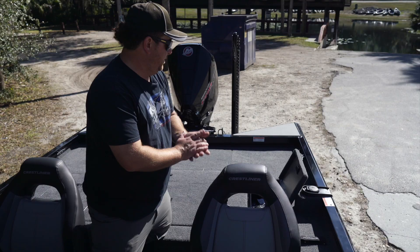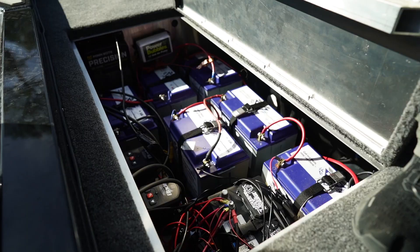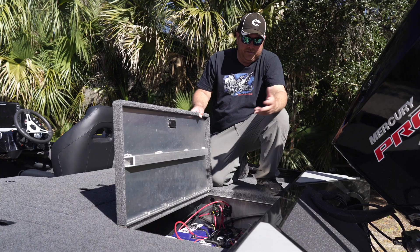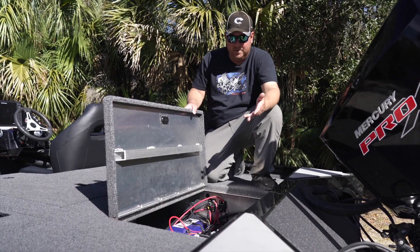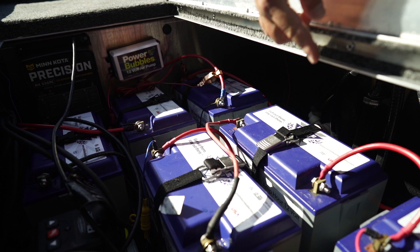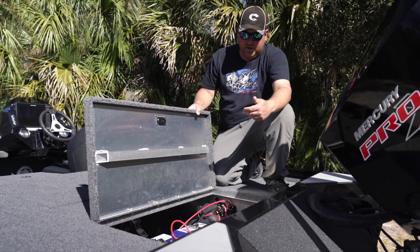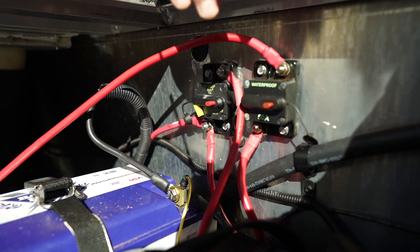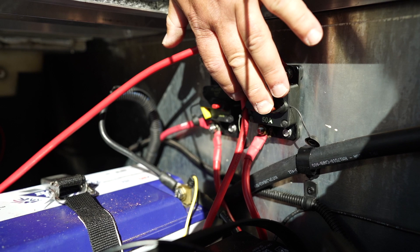This right here is what you won't find in many other boats, especially aluminum boats — this is my battery setup. This is how I keep going in tournaments when a lot of guys' batteries die and they have to come off the water. I've got six 12-volt lithium Battle Born batteries in here, plus a Power-Pole charge unit that charges one set and the starting battery — seven batteries total. Each set is on a 50-amp fuse so I can run one set and switch to the other if needed.